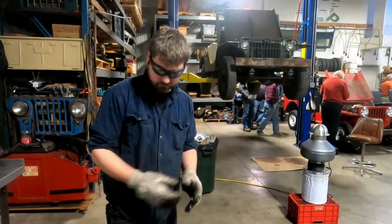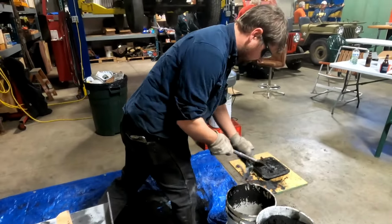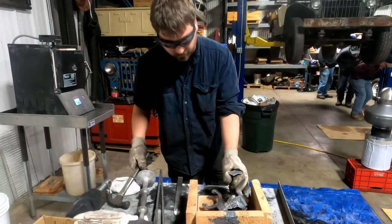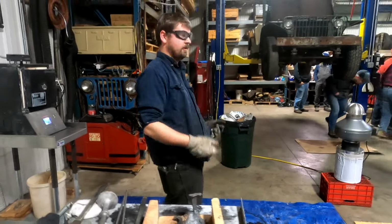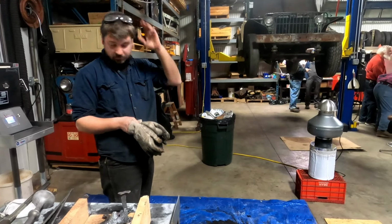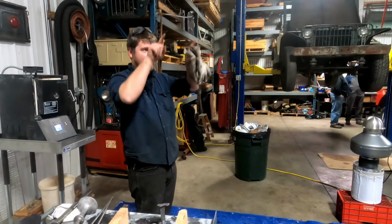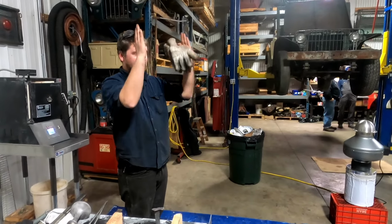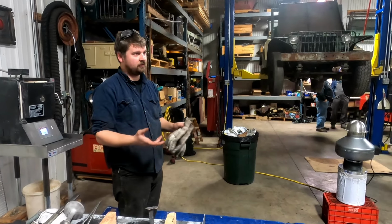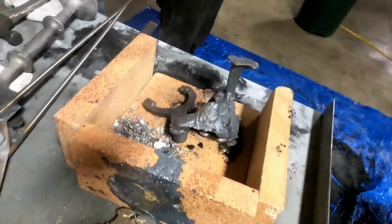Yep. And a 3 or 4 step machine process after that, depending on how we flip the pad. Yeah, depending on how we do it. I've got to figure out, like I said, if I want to do it on the lathe or on the mill. I can do it both ways. The interesting thing is the originals are actually flats. They're not round on the inside of the pads. They're flats. So I could just come with an end mill, go cut over cut, like a rectangle, because they are flats. Well, that's why we want to figure out how much, should we go over, should we not?